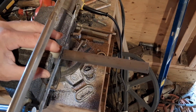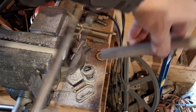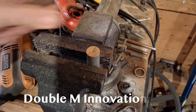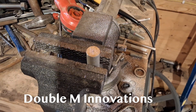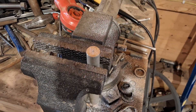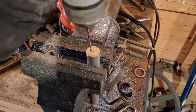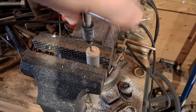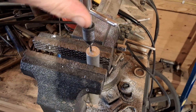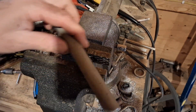All these guys are six inches long and all that magnesium still burns. There's a steel core in the center of these rods, so if you want to screw in there for a terminal you gotta drill off to the side. I'm just tapping some threads in here and I'll stick a stainless steel screw in there for the negative terminal. This stuff is pretty easy to machine.